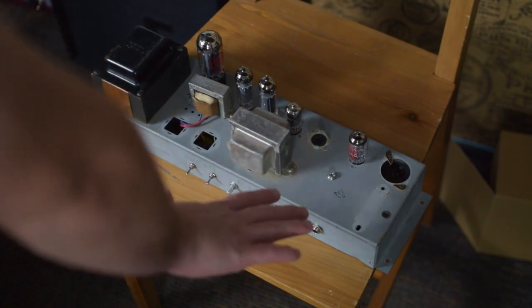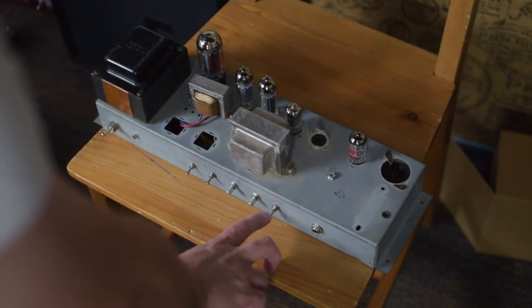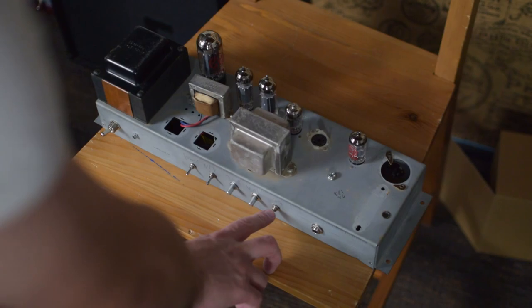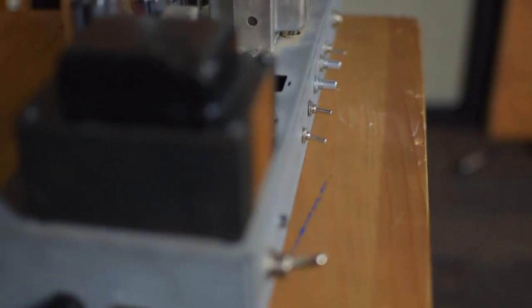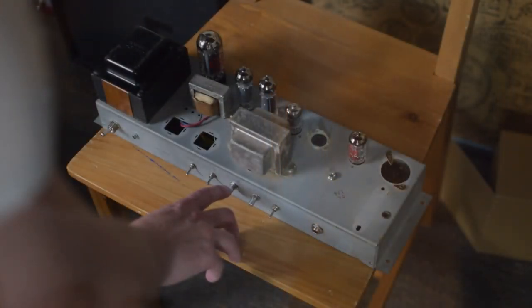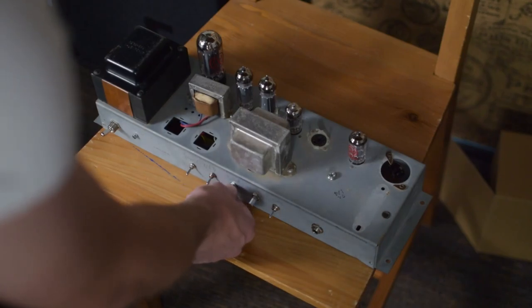The preamp is dead simple. We've got a cathode bypass capacitor switch. The cathode bypass cap is 0.68 microfarad, which definitely trims some of the low-end frequencies, so more of a mid-range and treble boost and definitely a gain boost. Volume, tone. The tone is pulled from a Dr. Z Carmen Ghia. So I think of it more as a thickness control.